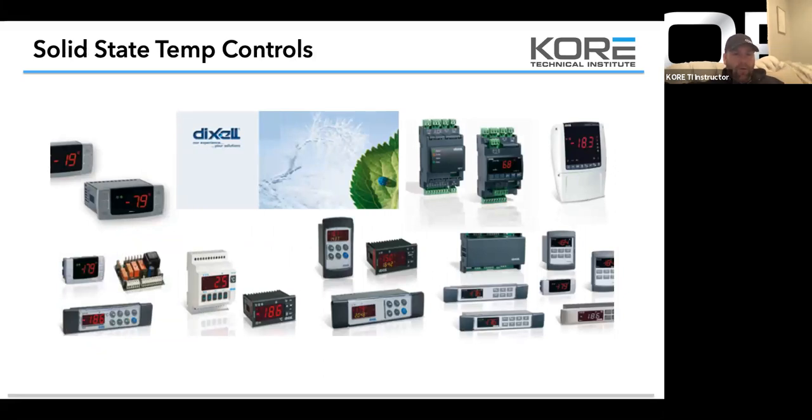Solid state temp controls. We're seeing a lot of these now. Most of your new stuff coming out is coming with this type of controller. Dixell was bought by Emerson. So you can see this can be network controlled or standalone, meaning it will run as the controller for a case, but it'll communicate with an EMS controller. Or you can see this as a standalone where it has an orange lead defrost sensor and a green lead temp sensor. So just understand what you're dealing with.